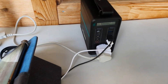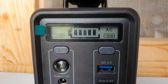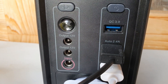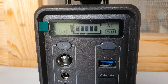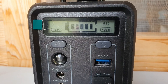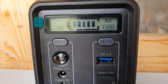How long does this take to charge? Well, that depends. You're going to get two bars on a really cloudy, wet, rainy day. You're probably going to get three bars on a cloudy day. And on a partially cloudy day, it'll easily charge. The input power — you can put about 40 watts into it, so it can charge 40 watts per hour from the 100 watt Renogy solar panel. Essentially, the panel on the top of the roof is actually overkill — you could easily charge something twice the size of this system and it would work fine. On a sunny day, I've got so much power it's ridiculous. I can fully charge every single item in the cabin and have tons of power left over for the end of the day.